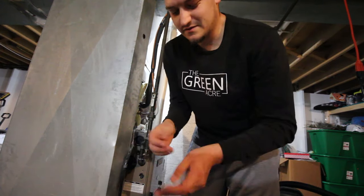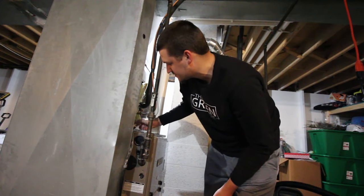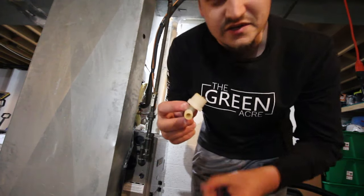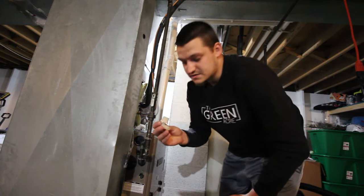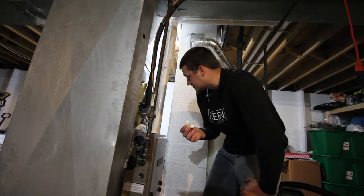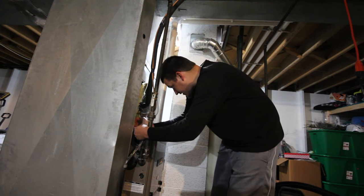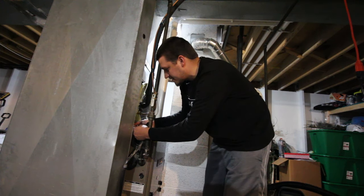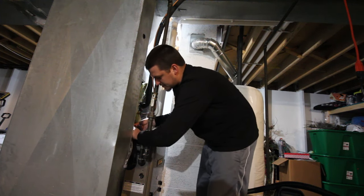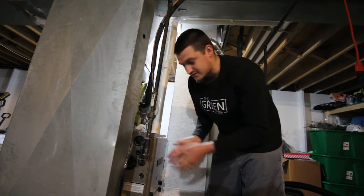Well, you win this one mom — this wire's not helping like I thought it might. But I can unscrew the elbow. We'll just unscrew it and clean it out. Looks like there's little pieces of — I don't know — wood chips, maybe OSB particles that somehow got in here. I'm going to take this and clean it in the sink and reinstall it. I need to find out where that other drain ties in before I start taking things apart. Okay, I've got our elbow cleaned out. I'm reinstalling it now. There was no Teflon tape or pipe dope on it — it was just screwed into the fitting, which is fine since it's not under pressure. I'll make sure it's pointed slightly downward to keep the flow coming out of the unit.